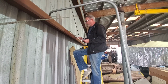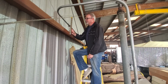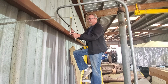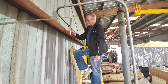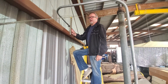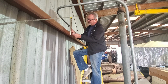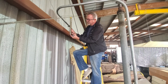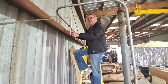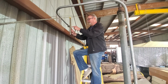My system for securing the conduit is a small piece of the half-height unistrut fastened through the edge of the girt. So got these nice little vinyl caps from McMaster-Carr. Keeps you from gouging yourself on them. So I'm going to just basically eyeball the center of this, and I do 10-foot centers on the spacing of these.